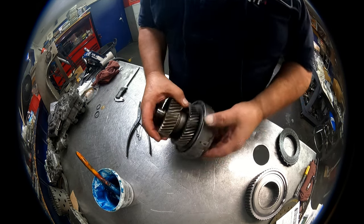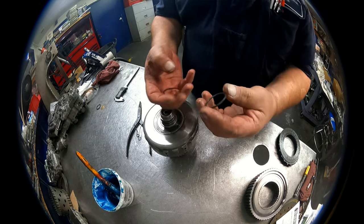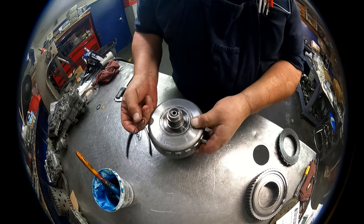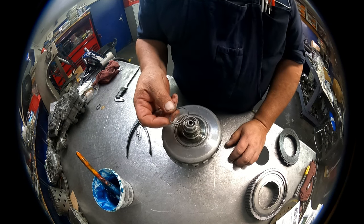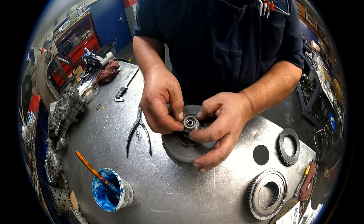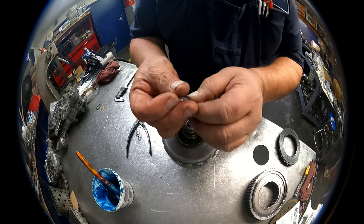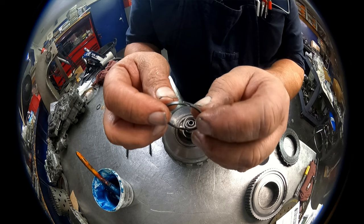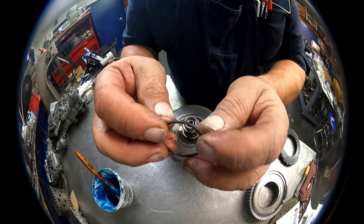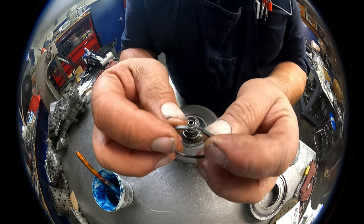Oh, on the back side here, be careful changing these out. Especially with the cheap kits, they tend to not fit properly and not seal properly. Even with the good kits, I usually do not change these out. They are scarf cut. They are plastic. Be careful bending them out. You want to go just enough to put it on there. You will break the back of them. You will not fill it, and they will not seal properly.